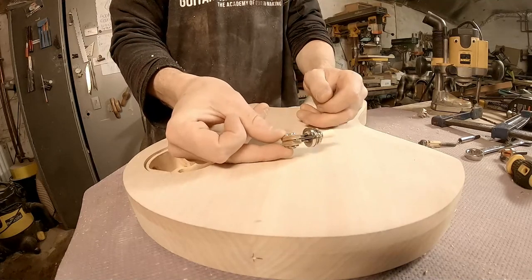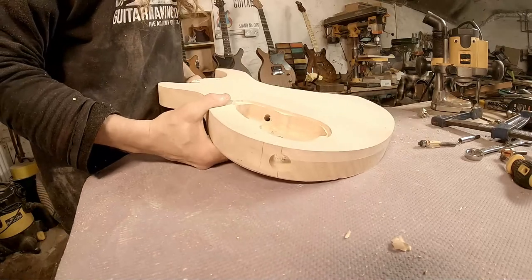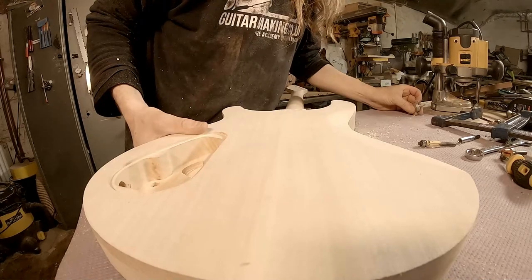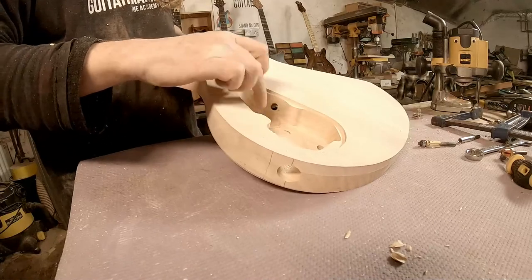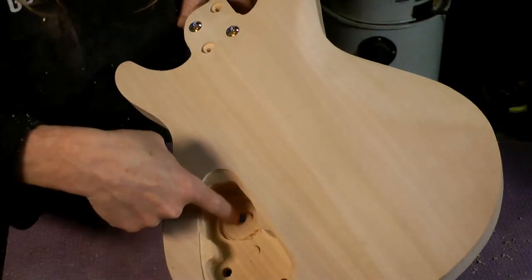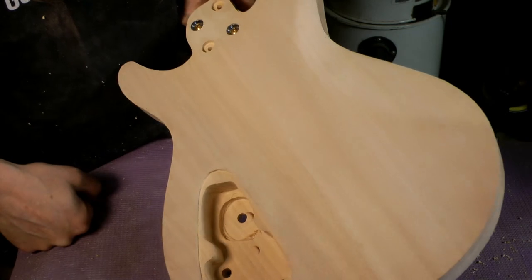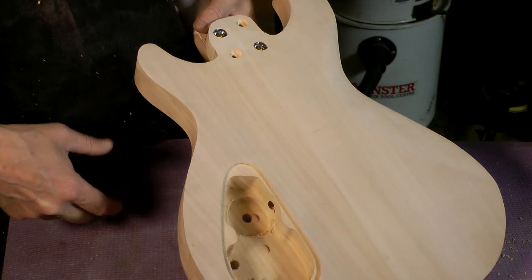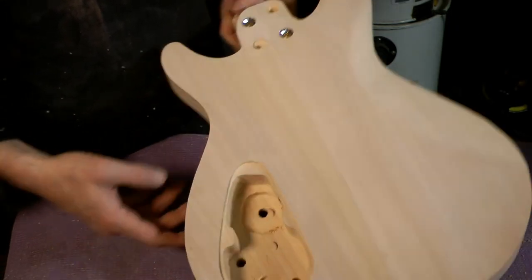So what you end up with is about 3 to 4 mil. Is it? No, you end up with a quarter inch, of course, of wood left in the middle. So you end up with plenty left. That's 6 mil of wood in there, so it's quite solid, not a problem. Longer shafts might save a little bit of time in some cases, but there are thinner body guitars where you wouldn't get them in. So that's why we don't use them.